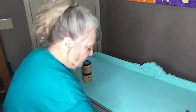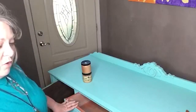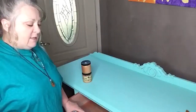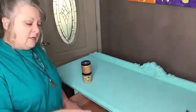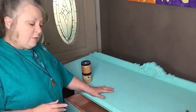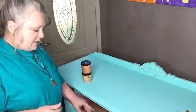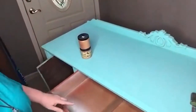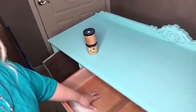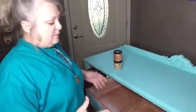The next decision that I've made is I'm going to paint the inside of the drawers with the Dixie Belle white. I think it was drop cloth. I have it here in case I wanted to do any highlighting with it, but it's going to be too much. I painted the inside of the drawer, the door areas there, with the old 57, but because that's the DIY paint and that's going to require a top coat, that's more steps than I want to take for the inside of the drawers. But because there's overspray and stuff like that in them, something has to be done. I'm going to continue to look for maybe a drawer liner or something to go in here, and of course you'll see that if I do, but it can't be too busy because of how busy the rest of the piece is going to be.